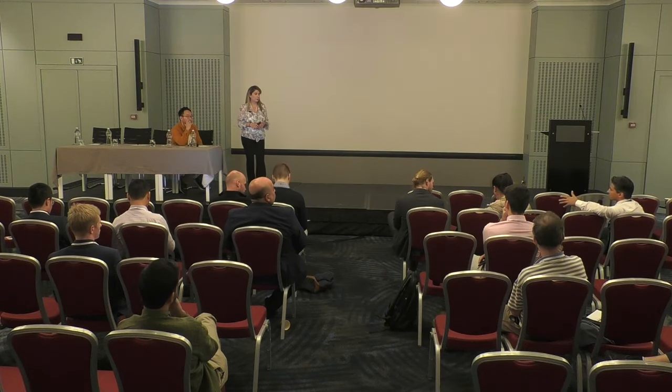Yeah, should I answer this? You mean the software will simulate... Yeah, so you get software packages like Mentor Graphics or even ANSYS. They have electromagnetic finite element simulators, right? And you can put your PCB, you can put your sources and your victims and transmission lines, and you get a 3D plot of how the noise is.